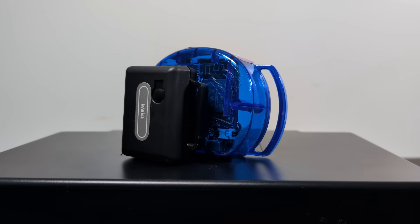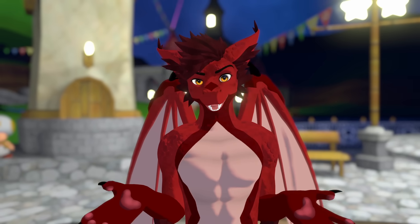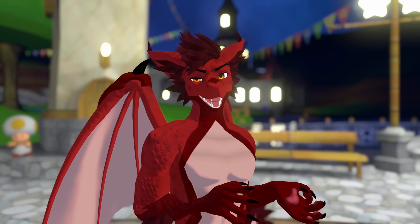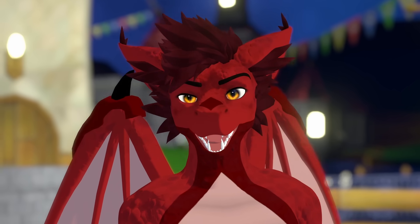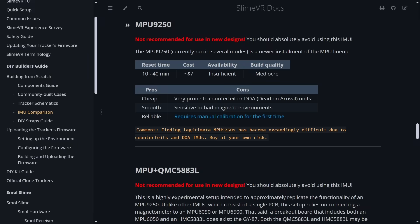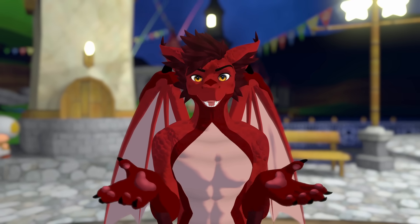IMUs for trackers like these basically just determine how fast they drift. I had a guess based on the listed specs — ICM-20948s, which are generally a pretty bad IMU. I actually asked ReboCap since I was getting better drift times than I'd expect from an IMU like that. Well, the answer is actually worse: they're using MPU-9250s, which in general are absolutely terrible. Somehow ReboCap manages to make these work using great software.